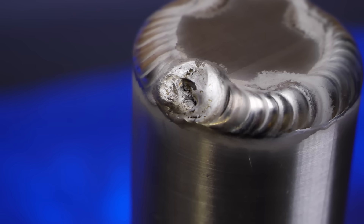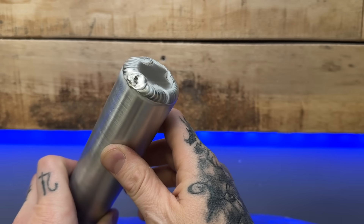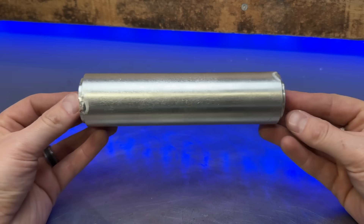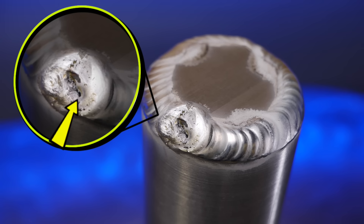For some people, no matter how hard you try, you can never actually seal this one up. I don't know the proper term for it, but I've always referred to this as blowback. What's happening is we are basically closing up a sealed area. As we weld, it heats up the base material — but we also have hot air and gas trapped inside that compartment. As we approach the point of sealing the area, the trapped air is being heated up and expanding with nowhere to go. Near the end, it makes its final attempt to escape, pushing back and blowing the shielding gas away. This creates the gross-looking area we can see here, as well as a hole that we can't effectively seal up.